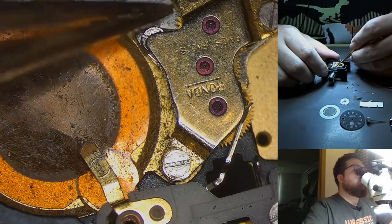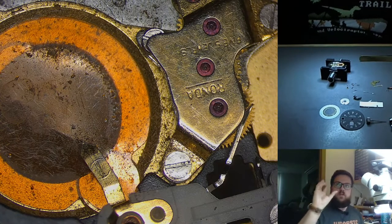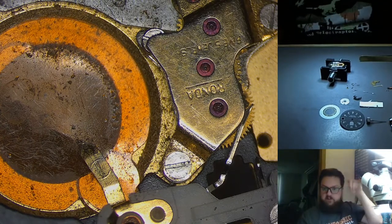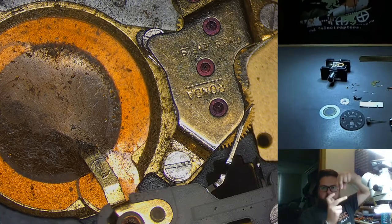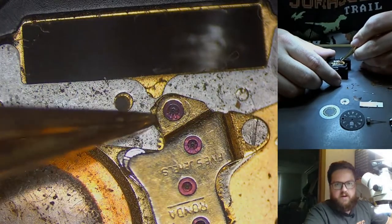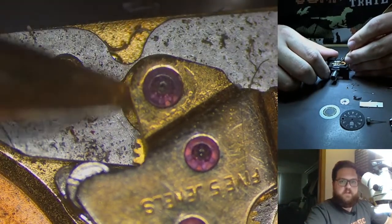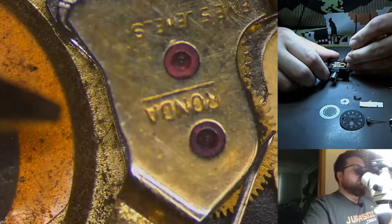So what this is, in a mechanical watch, a wheel. You start back at your spring. You wind up a spring, and the spring's attached to a wheel. And that wheel turns the pinion on the next wheel, or the next gear, whatever you want to call it. And then that pinion, which is like a smaller gear, makes the bigger wheel spin, which moves to the next one, and so on and so on. This coil kind of acts as our spring, and it makes a pulse, and there's a magnet on this wheel here. And then that magnet makes it go bloop, bloop, bloop, because it sends a controlled pulse, so that's how your quartz watch works. And then that moves all the way down the train. But it looks like this gear train is actually moving and working.